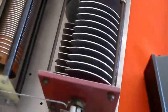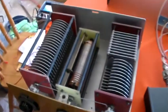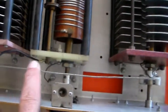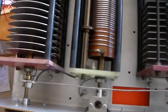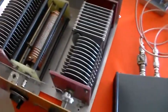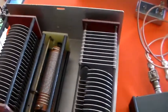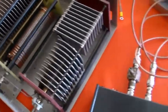Doesn't really matter on lower frequencies. I'll probably use this on 20m, and I've used it on 40m and it works fine. I'll probably get around to replacing the fairly thin wires, connecting it all together with little copper straps or some more substantial wire, if I ever get around to building myself a HF linear. If I was going to make some power on HF I'd probably make a nice HF linear with one of those big Russian triodes in it, or an 8877 maybe — something that will give me full legal power with very little effort.